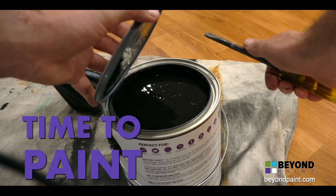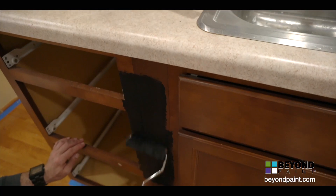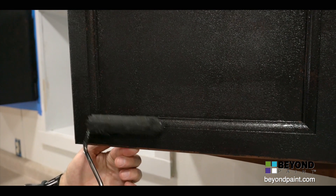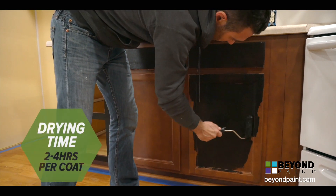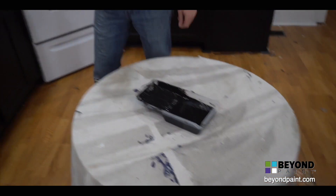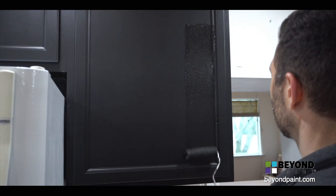For this particular project, a 4-inch roller with a 3/8-inch nap is recommended, but you can also use an HVLP wide nozzle sprayer to apply Beyond Paint. You can use a brush or the soft side of a roller to mush or stipple hard-to-reach spots, but roll all possible areas and allow 2-4 hours between coats. Allow 7 days for the paint to fully bond. The low VOC of this paint means no ventilation is required, minimizing downtime when showing and renting units like this one.